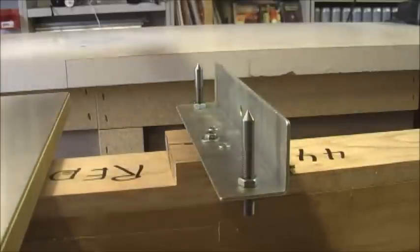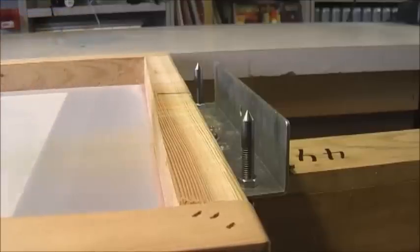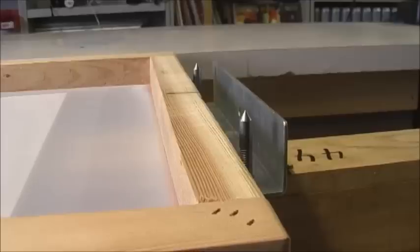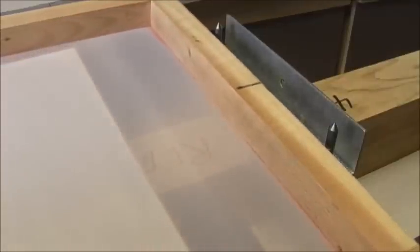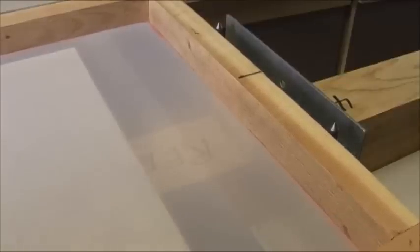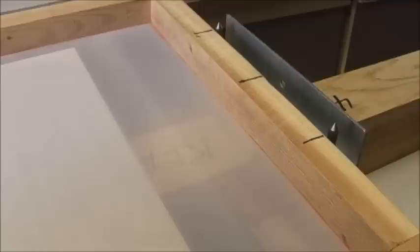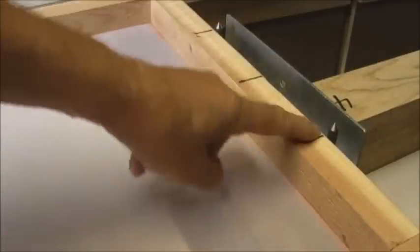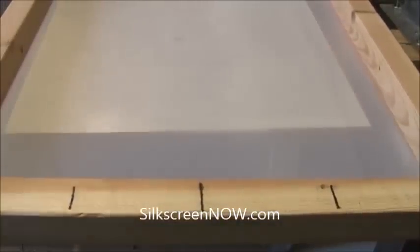The next thing we're going to do is take our screen. Now all screens are not the same dimensions, so you want to mark a center line. I have a mark here that measures the center of the line. Just going to push that up against the pins in the center, and mark two lines on your frame. This could be an aluminum frame or a wood frame — the wood frames tend to warp after a while, so if you can afford the aluminum ones. We're going to drill a hole right on those two lines — drill three-eighths inch holes.